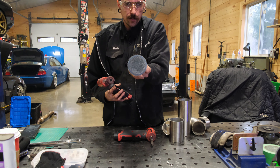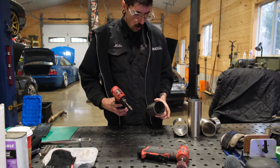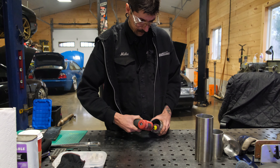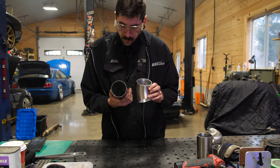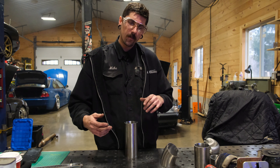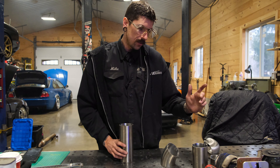I just pulled off this little flapper disc attachment. You can do so many things with these little tools, whether it's polishing, metal finishing — they're just great. Same with the little hand orbital sander. We're gonna clean up these tubes. On the inside I just get rid of this edge with the carbide, because it's stainless — this is what this is made for. This just cleans up the edge. I always just take a quick look at it, see if there's any more edging. Prep is everything. Spend your time, take care of the tubes, and just keep jamming.